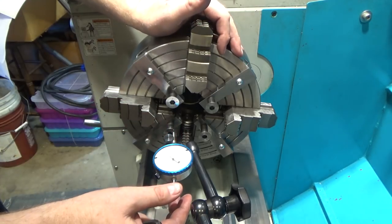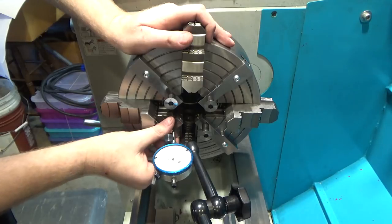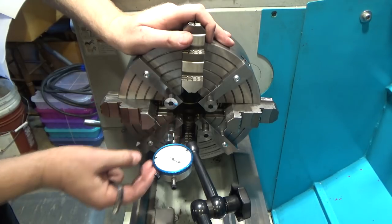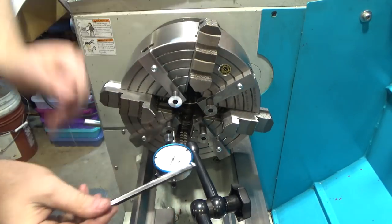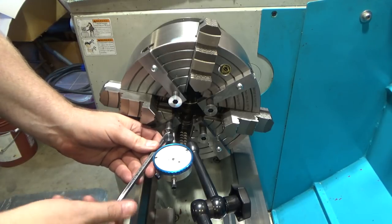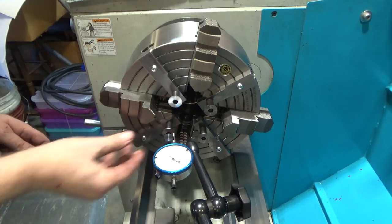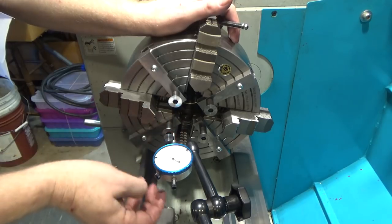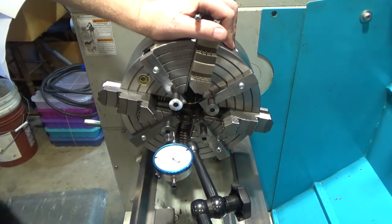So right now there's no tension on these screws, and actually I think that one's off by a full tenth, right? Let's see, that's three, and that is two, right? So we need to go this way. There we go. And they do need a little bit of tension on that nylon set screw. That's better. There we go. Again, I didn't tighten any of these, which I needed to, but just for demonstration purposes. Jeez Louise, that really does need some tightening. Okay, come back to my reference. There we are. So now all four of these are exactly the same height.